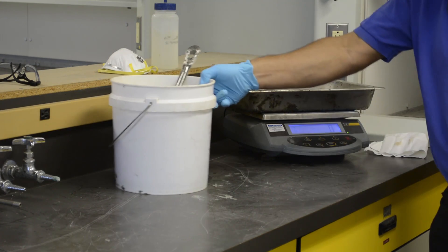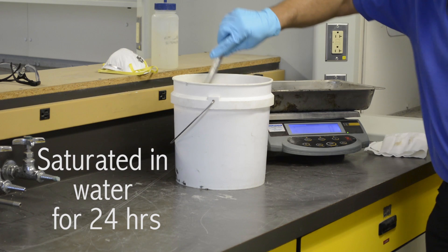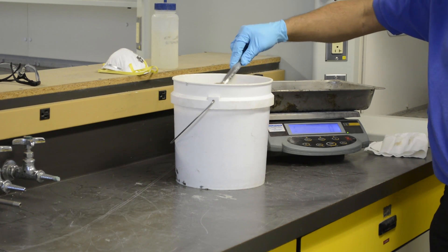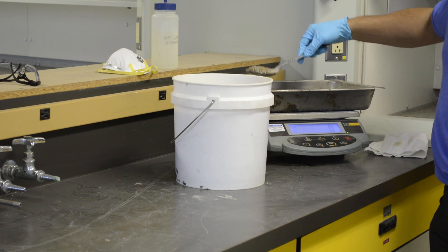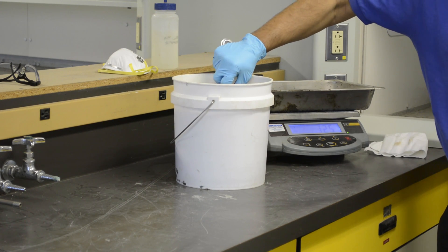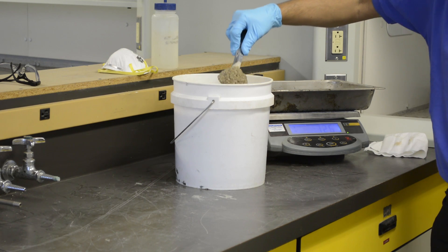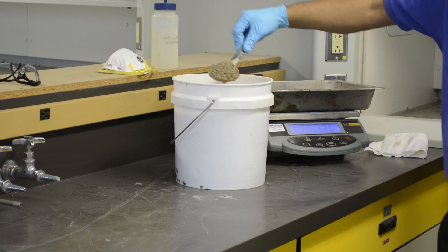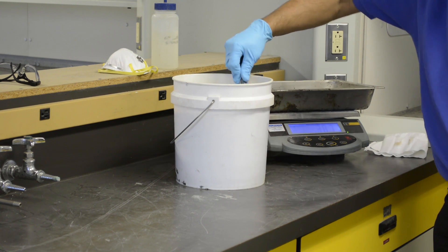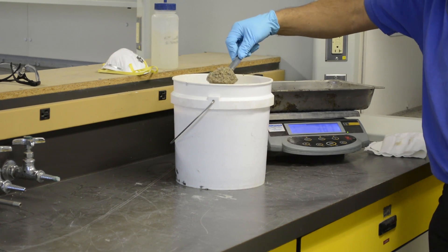The aggregate material has been prepared and has been soaking at least 24 hours. Obtain approximately 1000 grams of the fine aggregate from the sample and put it in the pan. While some of your team is preparing the aggregate sample to dry, another person can carefully clean the pan and dry it, making sure the pan is free from any aggregate.